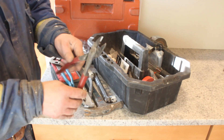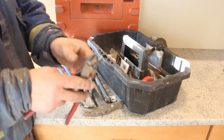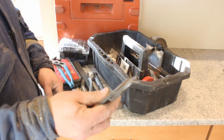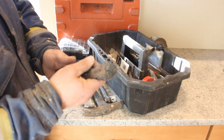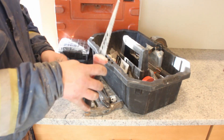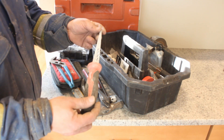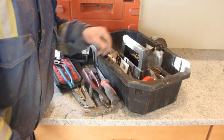We have crimpers. I do have ratchet crimpers in my truck in my big rolling toolbox, but for a lot of things these crimpers are fine. They give you a little extra cutter and you can crimp insulated and non-insulated connectors on wires. Keyhole saw for cutting sheetrock, cutting holes out, and making hand holes to run wires in — you need that tool.